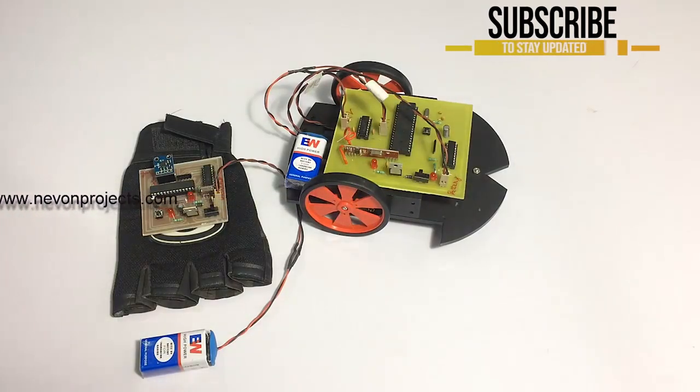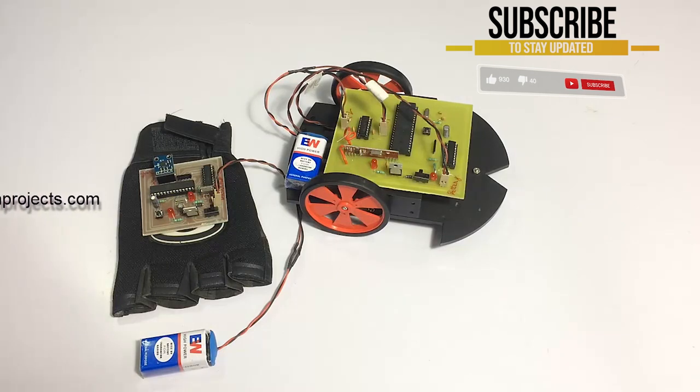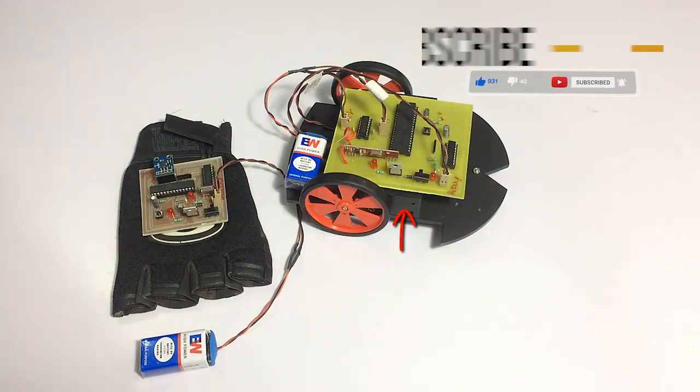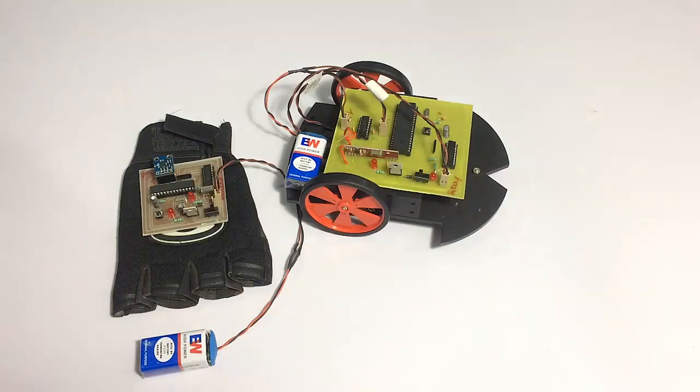The commands and the values sent by the transmitter are received by the circuit on the vehicle here. The vehicle consists of circuitry with an 8051 family microcontroller. The microcontroller is used to process the commands received by the RF receiver, and based on these commands it operates both the motors in the small robotic vehicle, and thus the robotic vehicle moves as per the user's direction command.